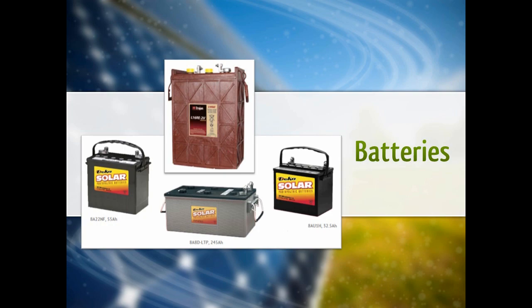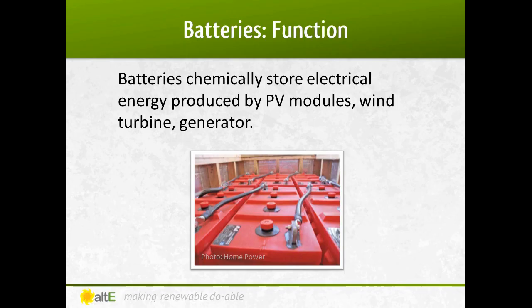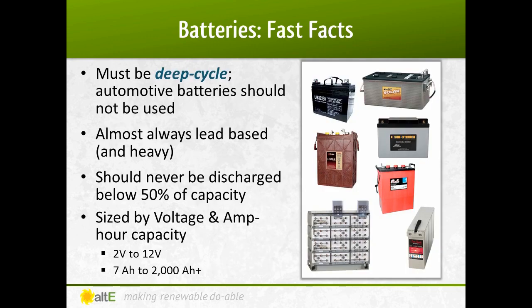Let's move off PV modules and onto batteries. Solar panels have no way to store power — you use it or you lose it. Batteries allow you to store power to use later by using the power generated by the module or other power source to charge the batteries. Batteries used in a solar system must be deep cycle batteries, which are made very differently from car batteries. A car battery has internal plates designed to send a short, high-current blast to start the engine, then gets recharged quickly by the alternator. A deep cycle battery is designed to be gradually charged and discharged over hours or days. If you try to use a car battery for an off-grid system, it will work for a short amount of time, but you will very quickly kill those batteries.